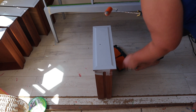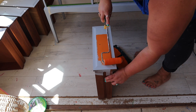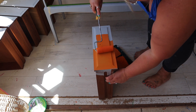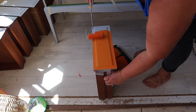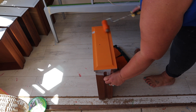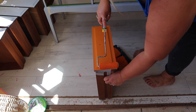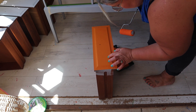If you use too much product you're going to get a lot of texture from the roller, and if you don't use enough product you will also get unwanted texture. The application for the paint is fairly straightforward. A lot of people struggle with getting a smooth finish but the good thing about chalk mineral paint is that it does want to self-level — it does want to be flat. That's not to say you can't achieve other finishes with it, but it does have a self-leveling property.